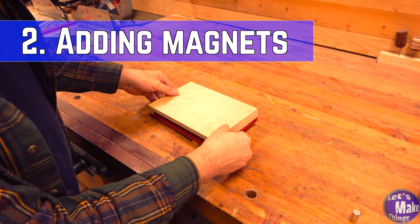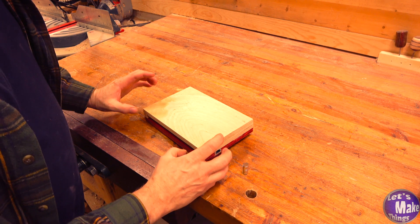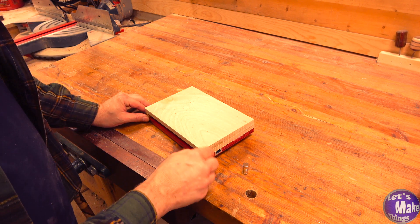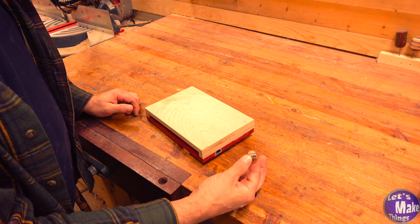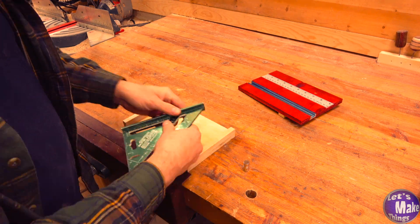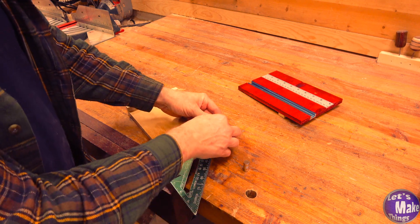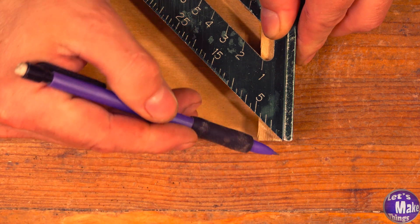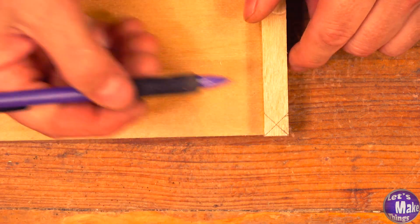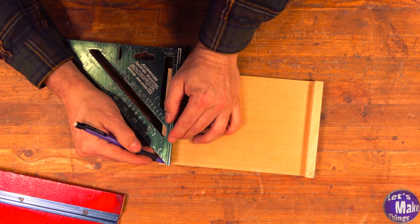Now we want this to attach to our base. I'll be using magnets to lock it in place. We want to make holes in each of the four corners all the way through to the base. These are half-inch rare earth metal magnets — I'll put a link in the description where I got mine. We'll flip our jig over and take a square to hit each one of these points and make an X, which will give us the center. We'll come to this side, get right up to the edge, draw our line, then flip and do the same thing. This is the exact center of this half-inch piece. We'll do that with the other four corners.